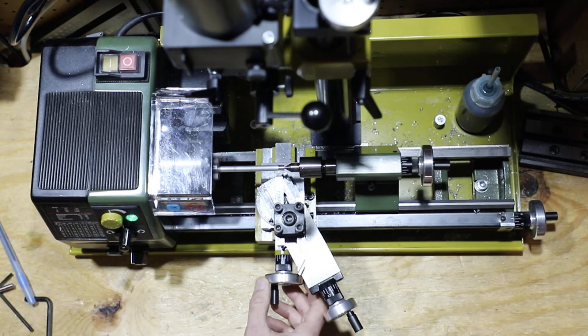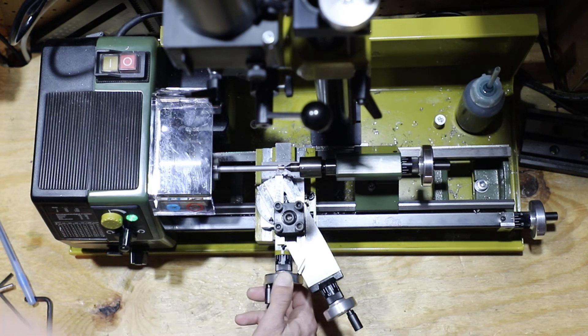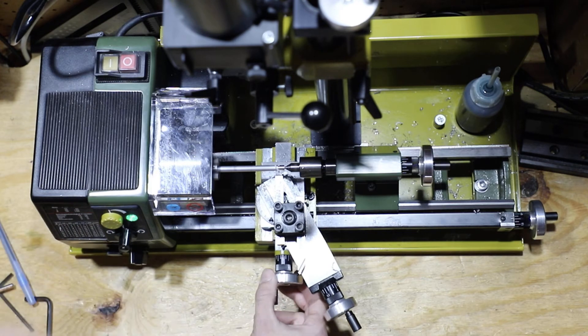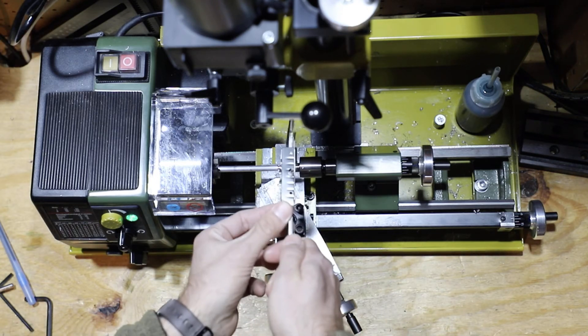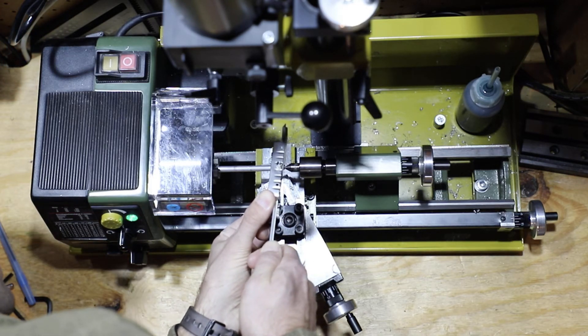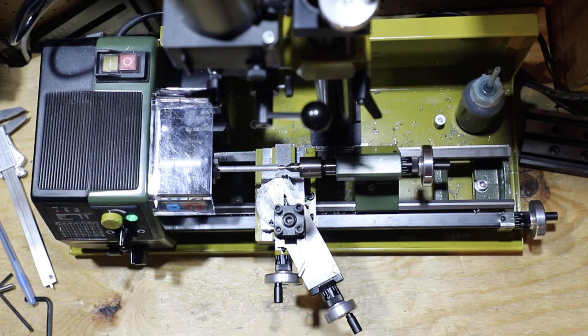Now I want to carve out a notch and chamfer it to where we're actually going to bring the thread to — we're not going to make the thread go any deeper. It's good to have a section cut into the aluminum that allows you to not overshoot when you're making your threads. We'll turn the lathe off and check our diameter before taking it all the way down to 4.8. This is a German-made lathe, so everything is done metric — even the gearing to make threads is metric; you have to special order imperial gears. Right now we're at 6.08 millimeter diameter, and we're trying to get down to 4.8, so we have another six tenths of material to remove.